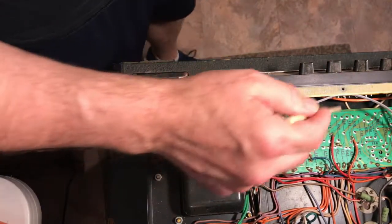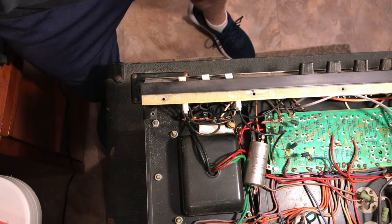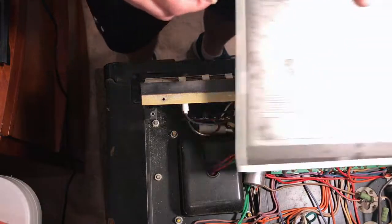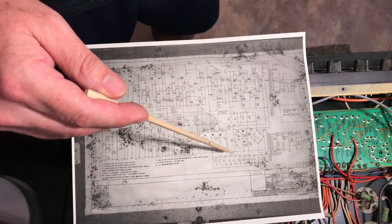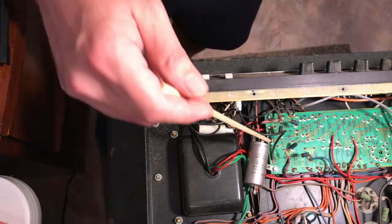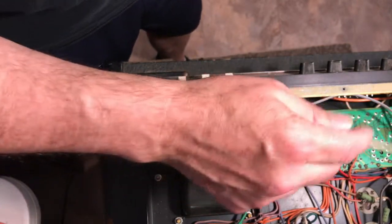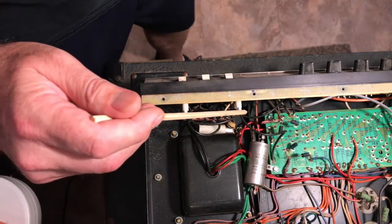All right, so now we have to figure out what this point is. And if we look on the schematic, I don't know if I can easily show this. That point is, let's see, can we see where that is? If you look, we see this diode here, and we also see the standby switch. This is the ground line in the schematic. So what we're seeing here is this point is connected in through basically the ground contact throughout this board. So far it has not touched the chassis, nevertheless.